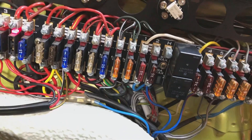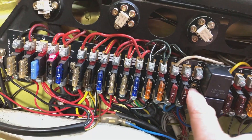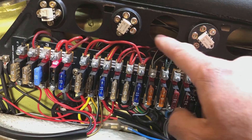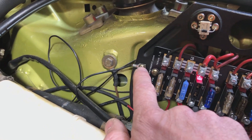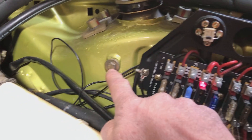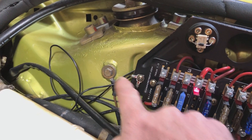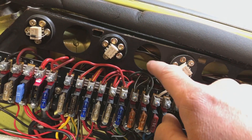That should be as close to zero ohms as possible — a direct connection. If it isn't, it's possible to ground this panel separately. You can do that over here — if you run this to a ground point, there's a handy one just there. So if you loop that to there, you can fix any problems if this metal plate isn't grounded.